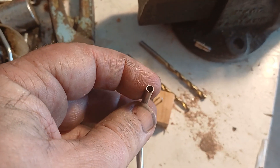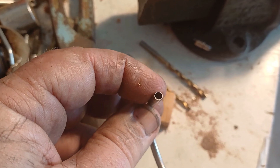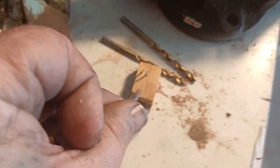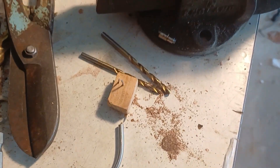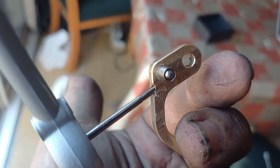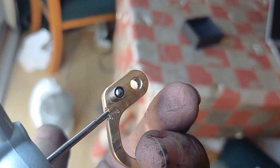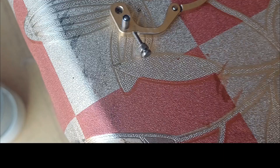To fit into the slot of the spinning part of the governor, I need to get the inside of that up to 3.5 millimetres — so we're going to put that inside a hole to hold it and then drill it out carefully. Threading that — that's the angle I wanted. You can see the extra 0.25 millimetres on each side of the pin, and we're putting the lever base here.